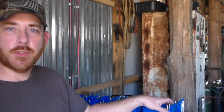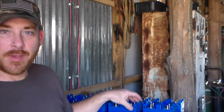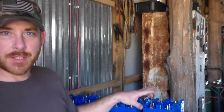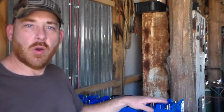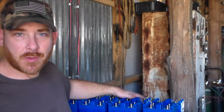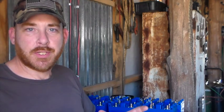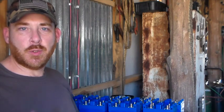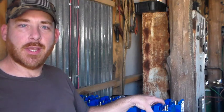So what I'm going to do is put two cells into parallel, times 8 — then I'll have 8 cells that I can wire into series and make my 24 volt battery. They call these supercells. Or I could take 8 cells and wire them into a 24 volt battery, and another 8 into a second 24 volt battery, and just put those into parallel. But in that case I'd have to have two BMSs for the batteries, whereas running it this way I only have to have one.